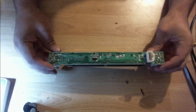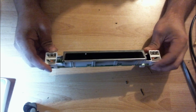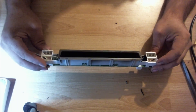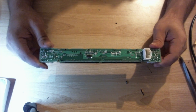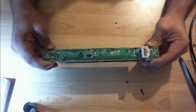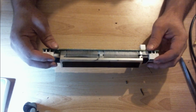How about a different video? Today I'm going to be working on this. This is a display that goes above the radio, or in the radio console for a Mazda 6 — I'm going to say late 90s, early 2000s, maybe mid 2000s at the latest. The complaint with this is some of the segments are out in the LCD, and if you flex the circuit board a little bit, the display comes back on in the areas that are missing momentarily.